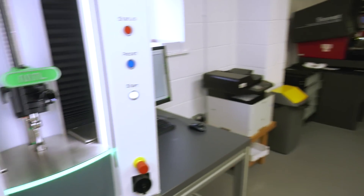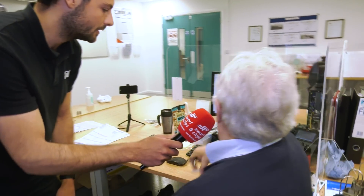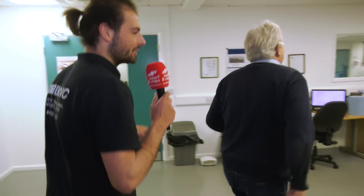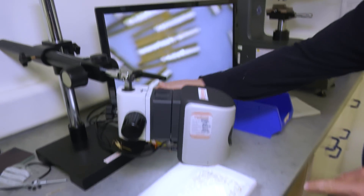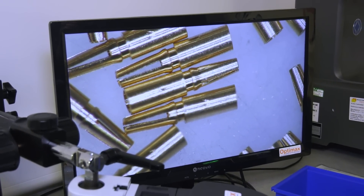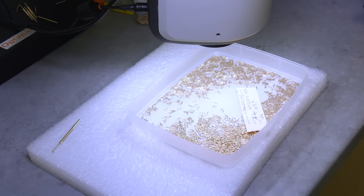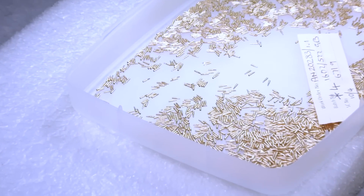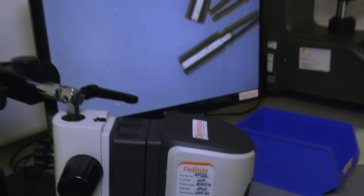There was a fantastic tiny part on here - could you explain how big it was? It's about two to three millimeters long, maybe half a millimeter diameter. These parts are so tiny that we have to put them under a microscope and magnify up to 25 to 50 times to be able to see them. You can only make as good as you can measure, so you have to invest in the optical equipment and the shadow graph technology. We have a camera inside, a USB port, we can take pictures and photograph parts and build up a library.